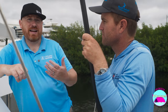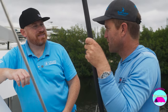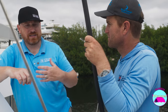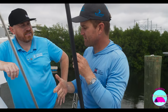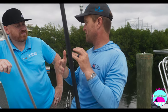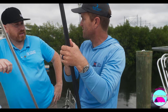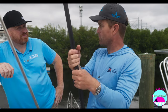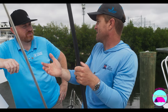We all want loads of sail area up because we want to get there quicker, but that's not always the case. These boats are incredibly well designed — they sometimes sail better when they're reefed down, so not only is it making you safer, it's making the boat faster. It can also prevent complete disaster: if you're truly pushing the boat too hard, there is literally the potential to flip the boat over in heavy enough conditions, or potentially dismasting from breaking a shroud due to overloading. So it's a massive safety feature, besides the performance and comfort gains.